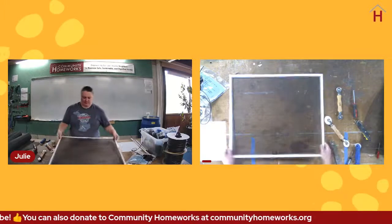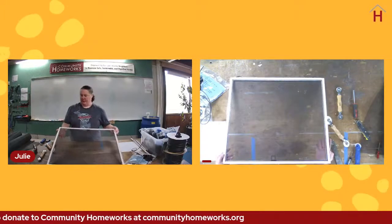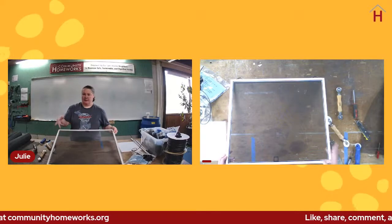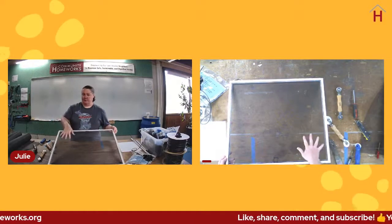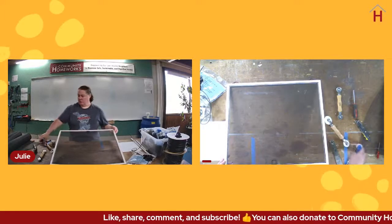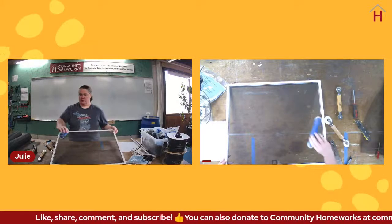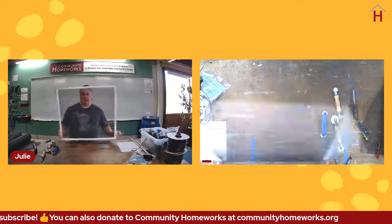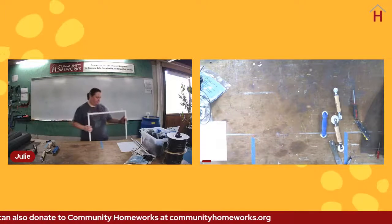So that is the simplest issue to fix. You have screen that's pulled away, or you have spline that's popped out and it's letting insects in, but the screen itself is intact and the spline is in good condition. This tool allows you to just reseat the screen and reseat the spline, and this is fixed and ready to go.